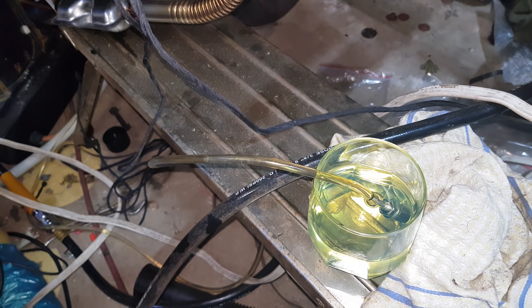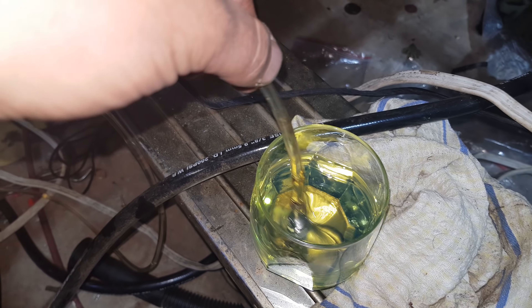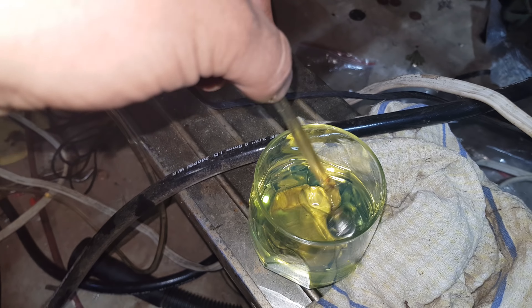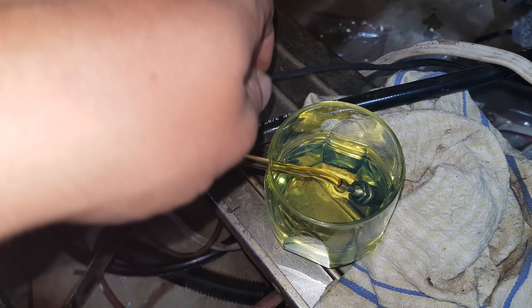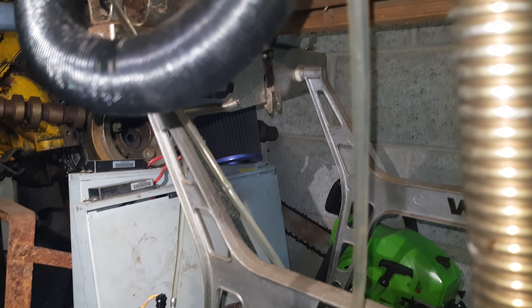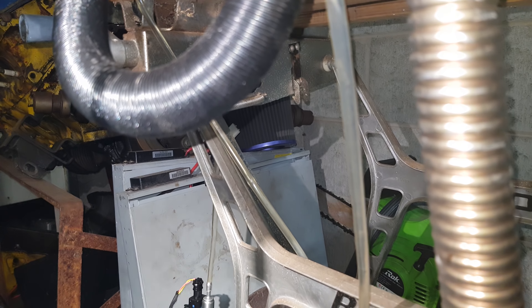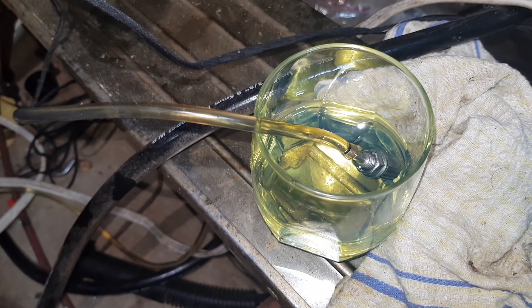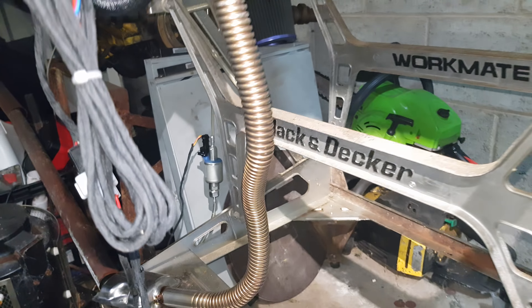I'll come back in a couple of minutes and see if it's still running. I'll sit here and watch the hose get up to the burner and once it gets there I will come back. Still working its way up there so I thought I'd give it a mix. Now the air bubbles are pushed out — we are currently running on 50% diesel and 50% vegetable oil. There's no noticeable smoke at the moment. Still burning quite well.